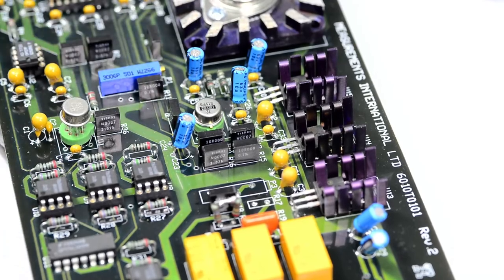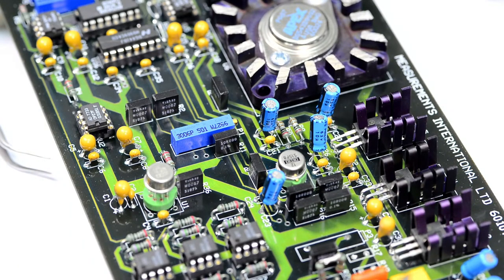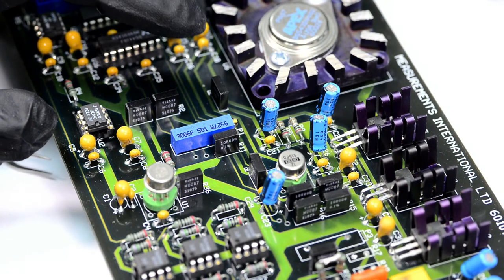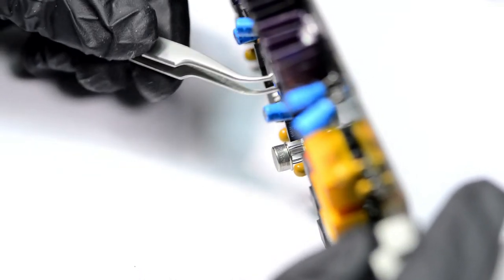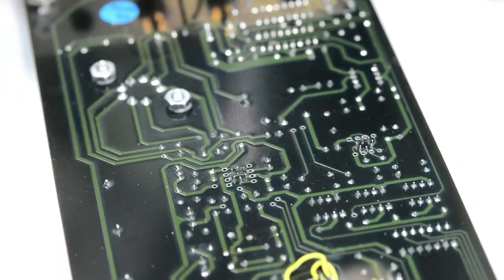And also I wanted to replace these guys. So the question is, for the 10 kilo ohms, either I put a divider in there, because a divider in theory has better tracking for the ratio, or just have individual resistors in there. You can take them out first, decide later. And let's make sure that we are taking the right part out.